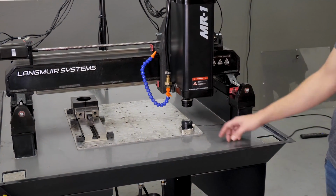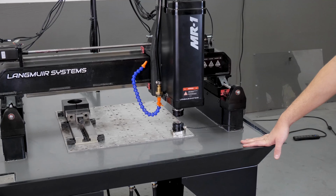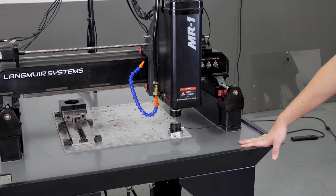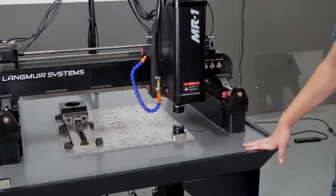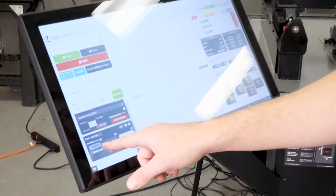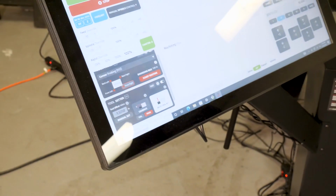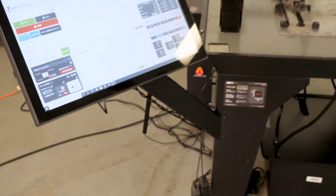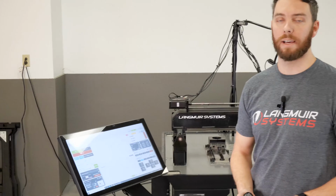So this is just going to come right down and touch the tool setter here and give us that calibration value. So now if I go look over here, I've got this tool offset value. We can see that that's now changed. So all I would need to do to run this part, pull the probe out, put my tool in, hit auto tool set, and I can hit cycle start and I can go.